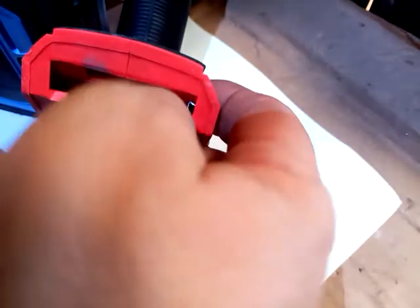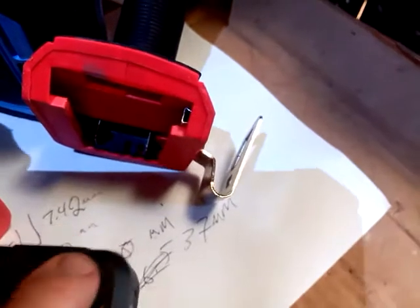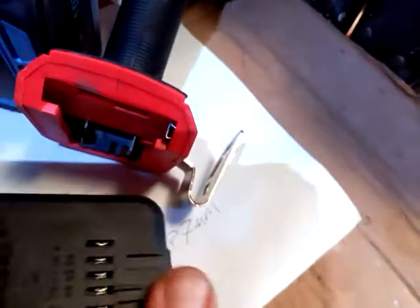Here's a VonHaus slash NoCry battery. It'll fit in this tool even with the extra chuck I put in here — with one hand I can easily slide it in, no problem. But now that I have that chuck in there, if I try to get the Bauer battery in, I cannot get it inside the tool — it won't go in. I purposely gave that inset a hard lip so you cannot get a Bauer battery in there, and therefore you cannot burn out your NoCry tool with a Bauer battery.